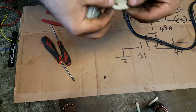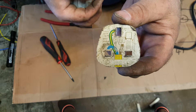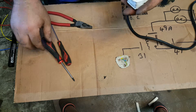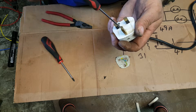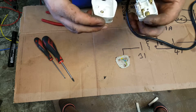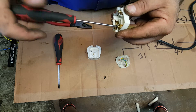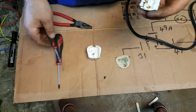So the first job — and this one's actually come with the original little wiring diagram, so that's going to be quite useful. You'll be able to press pause on the video and make a note of all that. The first thing to do is to open up the plug. I actually haven't done one of these for about seven years — that's how long I've been away from England. When you compare this to a New Zealand plug, you'll find they're a bit more substantial, really quite well made. The first job is to whiz round and just slacken off all the little wire clamps. You can see that one backed off — don't take the screws all the way out because they're really fiddly, just make sure they're fully open. It's a good idea to have a decent little flat screwdriver for this job.